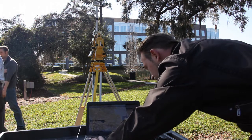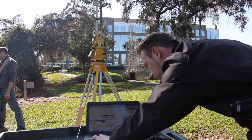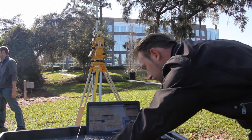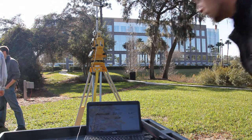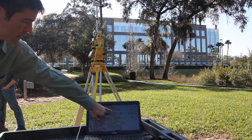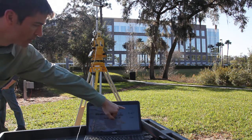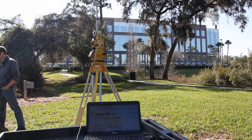You want to go to 322.9? Oh, here it says it's 322.9. He puts in the offset, so we move 5 degrees. It's showing the picture that we're using. And now it's saying that the measured is 235.13 degrees and 0.47 pitch, where the actual is 235 and 0.5 pitch. So we're within 0.03 degrees in pitch and within 0.13 degrees in heading.